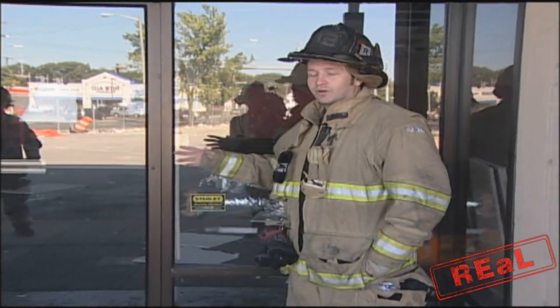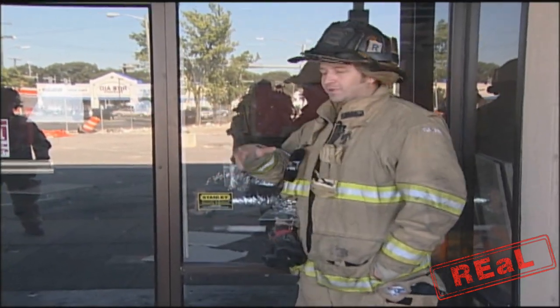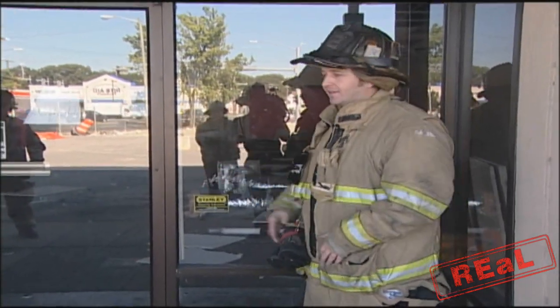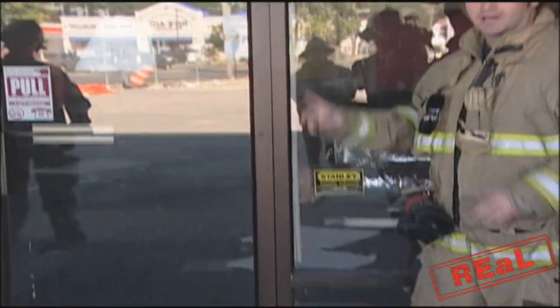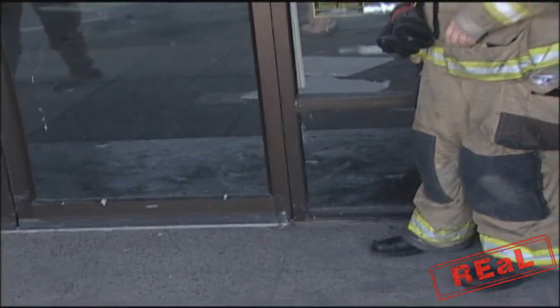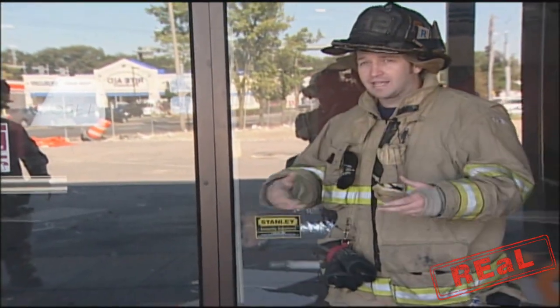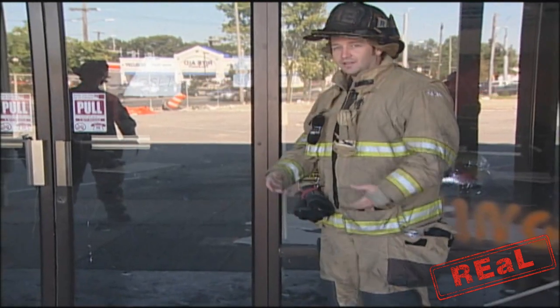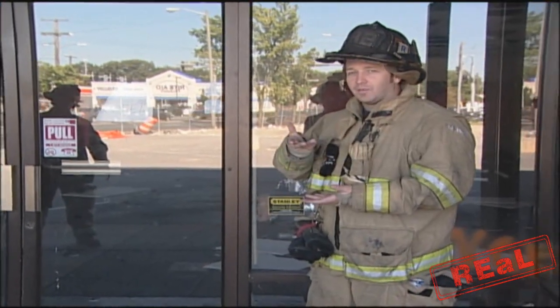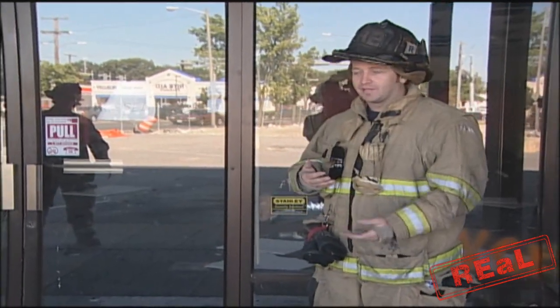By sizing up this door, we can take apart this door non-destructively and actually put it back together. If you see the way these hinges are set, there's a hinge at the top and at the bottom, with two pins inside of them. The bottom one is always the one we're going to attack, because as it gets older, dirt builds up inside the little groove that the pin sets in, which ultimately raises the pin up even higher, making it easier for us to pop and get off.